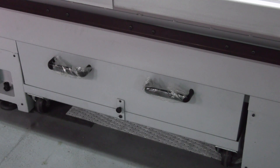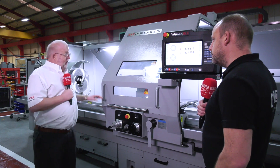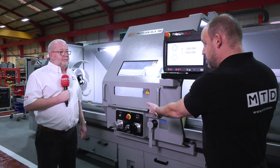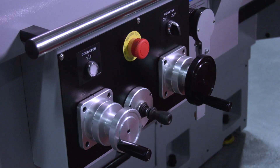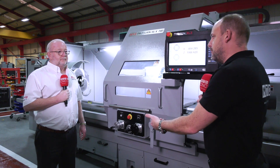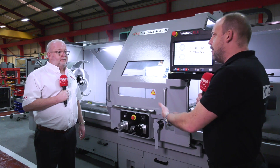Last one from me — getting the swarf out of something like this. I know we've got a couple of trays underneath it, but is that the only option? You can have a swarf conveyor that goes out of the back of the machine. And of course you can operate these machines using the old conventional methods — we've got the handles here, and you can teach it and all of those things.